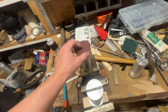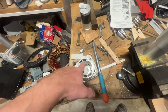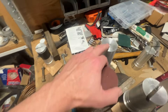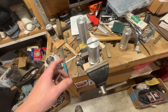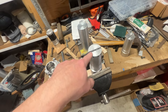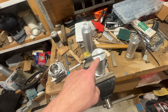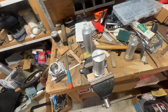I'll draw with a Sharpie so I have a witness mark — I've brought all the high spots down to the low spots so I know I have a smooth chamber again. Since this mandrel was faced, it's a perfect 90 degrees and I'll sand it, then slowly start cutting the chamber again. I like to leave the final finish with the cutter because that leaves a nice smooth surface, whereas sandpaper leaves little lines. So for the final bit I'll use a very light cut to clean it up.